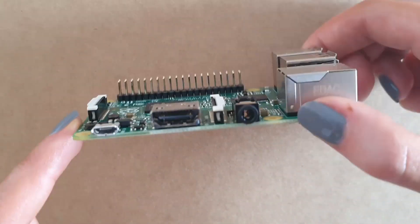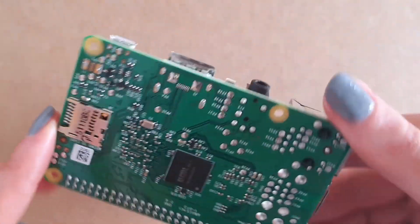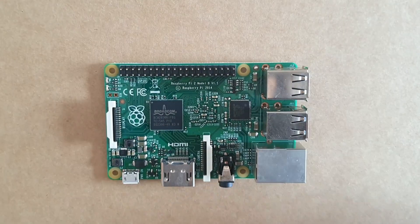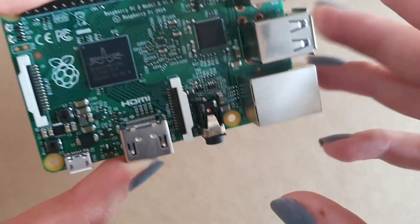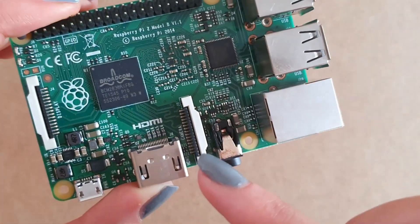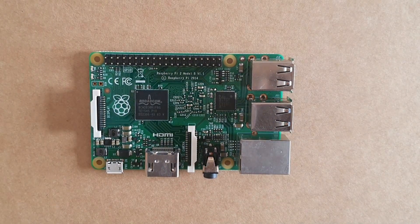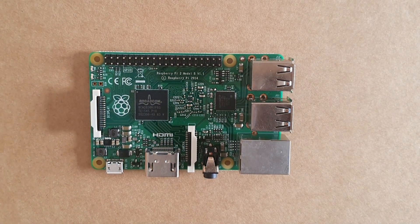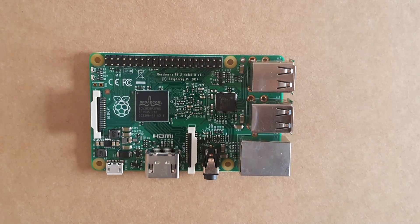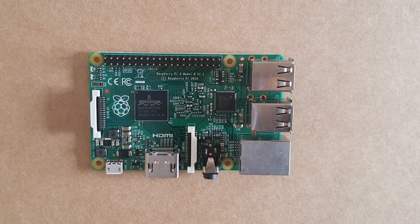This little micro USB port here is for supplying power to the Raspberry Pi. Underneath here, this little slot at the back is where you insert your SD card, which is going to contain the operating system for your Raspberry Pi as well as anything else you've stored on it. This little connector here in between the HDMI and the audio jack is for connecting cameras to your Raspberry Pi — you flick this wiper up and insert a ribbon cable for connecting them. And finally, arguably one of the more important things about the Raspberry Pi is these pins up here. These are called GPIO pins, or general purpose input and output pins. This is where you're going to connect any electronic components and all your other cool accessories, which will really take your Raspberry Pi to the next level.